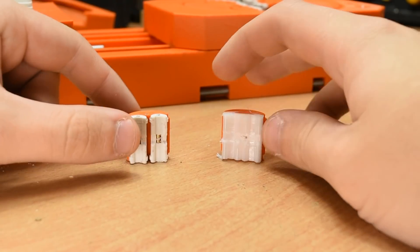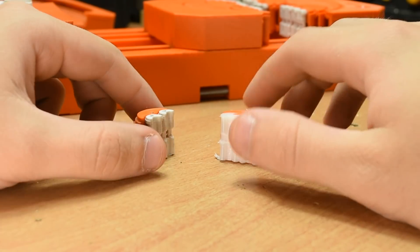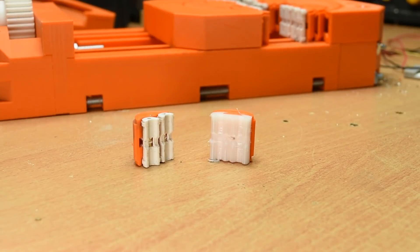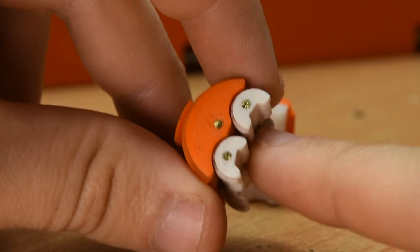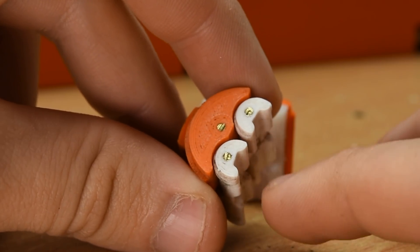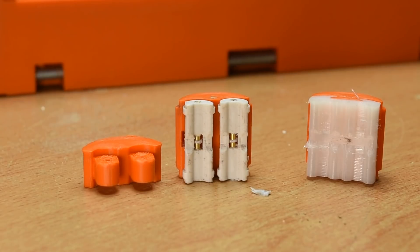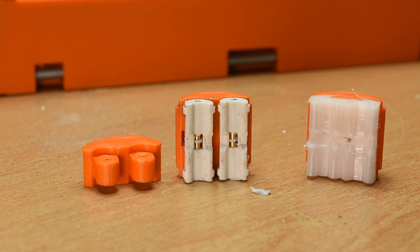To begin with, new jaws — specifically, new small jaws. Shown here are two types of jaws I've designed for this version. The difference between the two is that one is miles easier to make but somewhat less effective. The jaws on the left are the more complex option. They feature two tiny swivel jaws, just 9mm in diameter. At this scale, dovetails will not work, at least in plastic, so I had to come up with an alternative solution. I went with elastic and wire pins. These work fantastically, as you will see later in the video, but are very fiddly to put together and take some time.